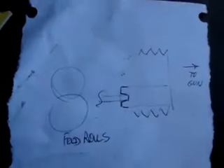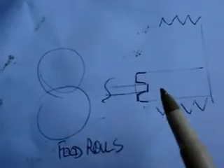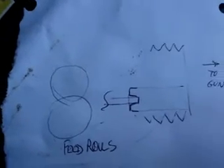This is a very crude drawing of what I'm talking about on the inside of the Euro connector. This is where the black tube is. Here are the outside threads on the Euro connector — the gun is that way, the feed rolls are this way. If you look close, you can see this is all brass at the back. And there's a raised, very small part that's also brass with a real thin wall — like a miniature sewing thimble down there at the bottom of that hole. The black tube slides into that from this end, possibly from the other end too. I'm not even sure if six and seven-sixteenths is the correct length.